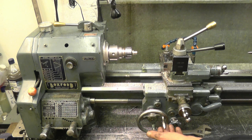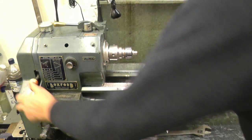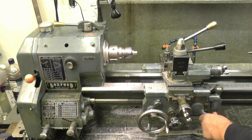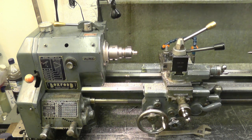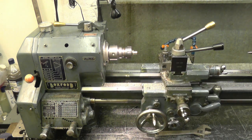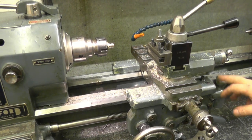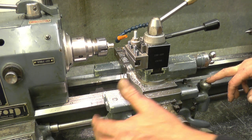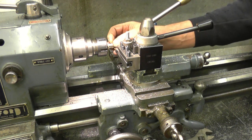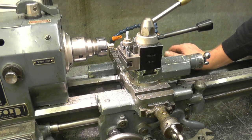See it's going the wrong way — I've only had the lathe 10 years! If it's engaged there it's going towards the job, so it's going to cut a right hand thread. This lathe has got a thread dial indicator. Being an imperial pitch I could use that and keep knocking the carriage out of gear and reversing it. But for such a short thread as that, I'll just leave it in gear and reverse the lathe. The lathe's fitted with an inverter, which makes going forwards and backwards easy. That's the way I'm going to cut the thread.